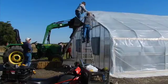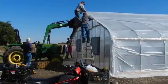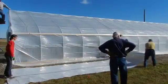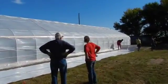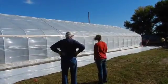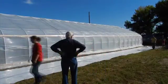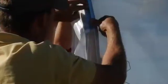Once the structure is set and secure, the double polyethylene cover must be attached. This is best accomplished on a day with no wind. The preferred method is to unroll the first layer of the gusseted plastic down the ridge from edge to edge and undo the folded gussets towards the ground. Secure to the baseboard temporarily in case a breeze comes up. Then install the second layer on top of the first layer. Permanently secure both layers of the poly using wiggle wire continuously down the lengths of the heated high tunnel and over the end bows.